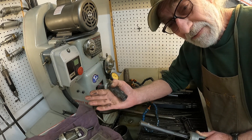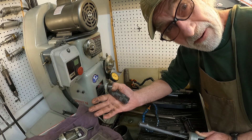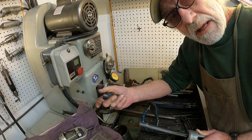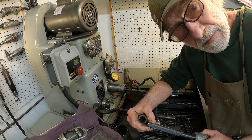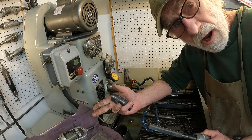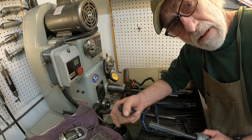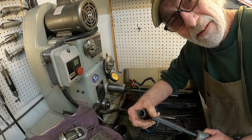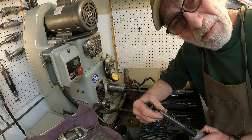You can dust things out if something's a little bit undersized — like five tenths undersized — you can't really bore that out on the jig bore, but you can dust it out here with no sweat at all. In fact, Sunnen hones have really eliminated a lot of internal cylindrical grinding. It's almost a secret weapon in a lot of industry.